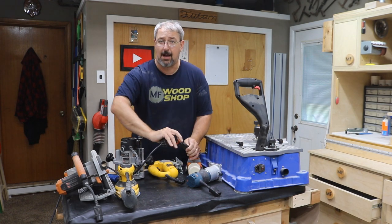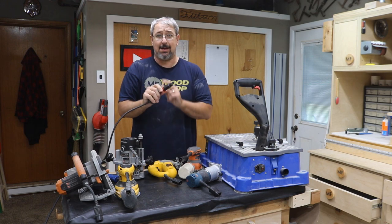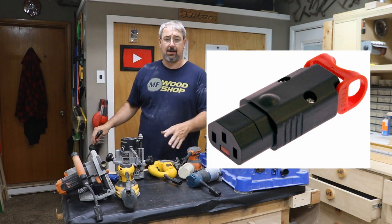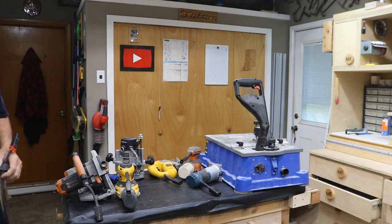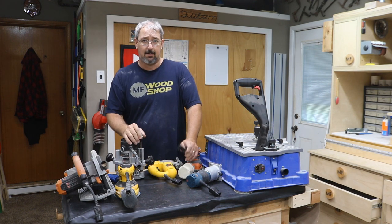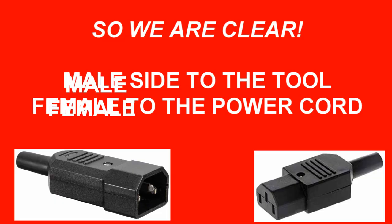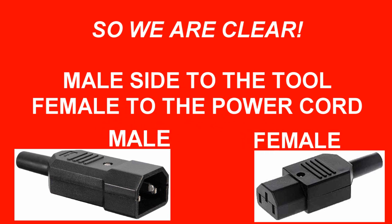That connector is a locking connector, so you can't really pull it apart unless you pull the trigger. I would recommend definitely having at least one cord with a locked connector. I'll put links in the description for some of the connectors you can buy for this setup. I'd recommend getting an electrical reel rated for 10 amps or higher and putting the male end of the IEC connector on that. I actually just ordered another 10, because over the last four years I've gained a few new tools I'm going to be putting this connector system on.